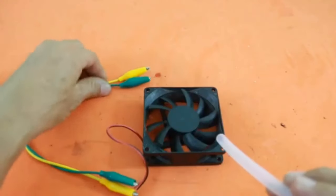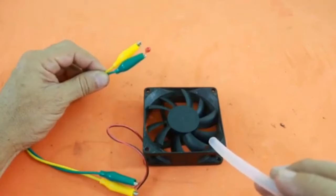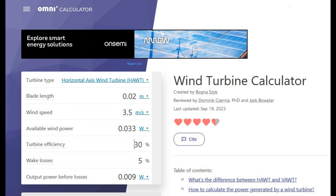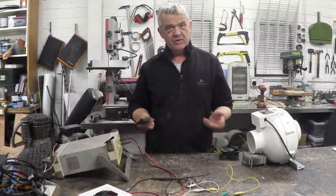Dead quick, dead easy to do. You'll see them lighting up LEDs, but the question is exactly how much power does it generate and is it worth doing? So I took one, converted it, measured the blade length — the blade length I used was two centimeters. If I put that into a calculator it gives me a figure for what a two-centimeter blade in a 3.5 meters-per-second wind should generate. The blade length here is two centimeters.